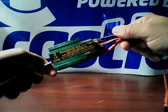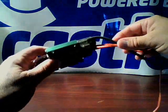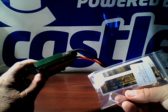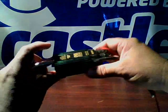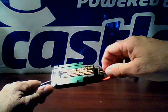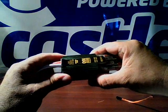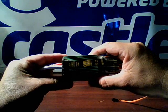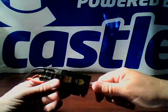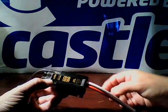The hardest thing was taking the controller out of the model, but that's pretty quick and easy. It comes with new labels — I actually used the old labels and it was real easy to pull apart. We're sending out new labels and heat shrink, you just install it, slide it back together. If you'd like, you can send it in to Castle to have that done for you. On new 160s, there'll be a label that says revision 2, which helps you identify that the update has already been done to the controller.